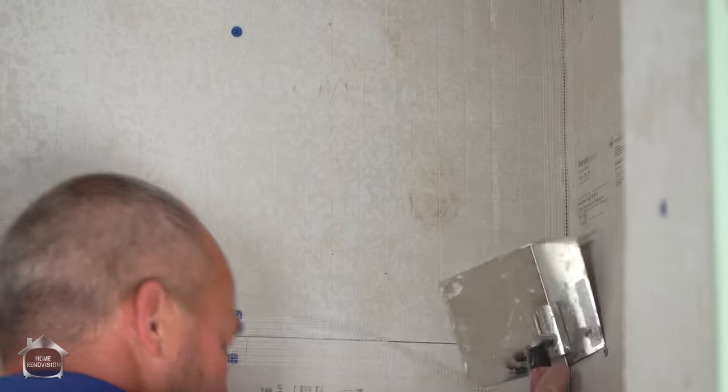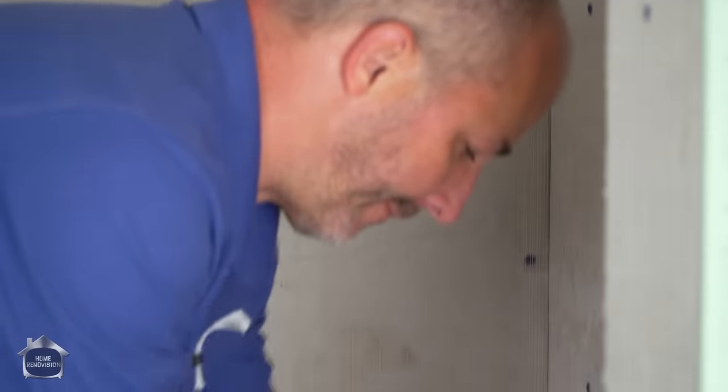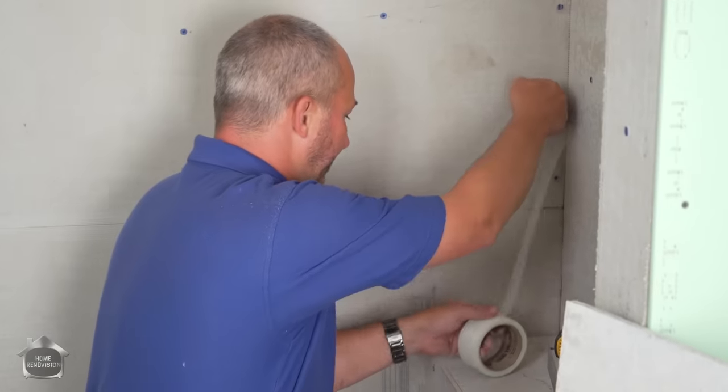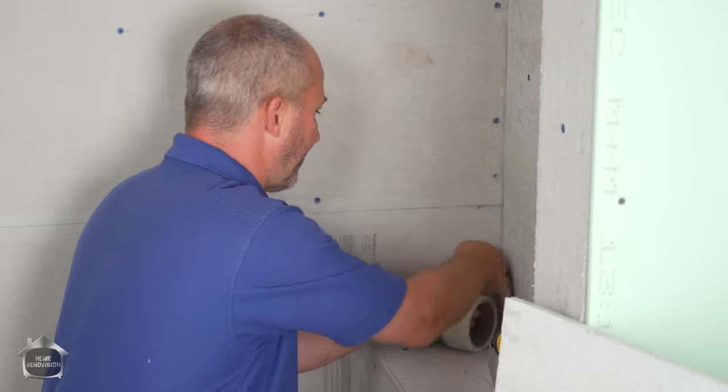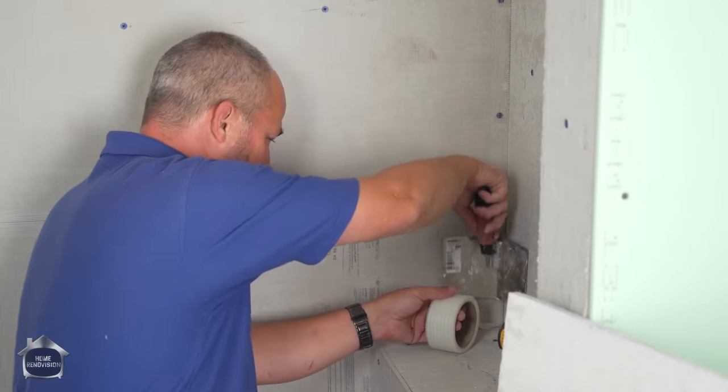Yeah, really handy inside corner trowel. We're putting mesh on these corners. It's not too often you use mesh in a corner. If you're stuck on a drywall job, you can do it. You want to use a quick set cement in those applications. And the same thing here, since we're using a quick set cement, I can use this corner trowel just to embed the tape.